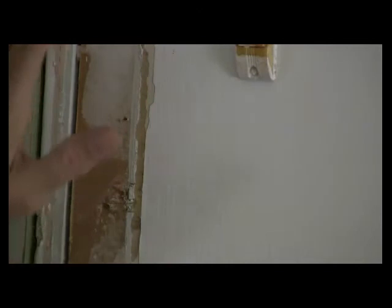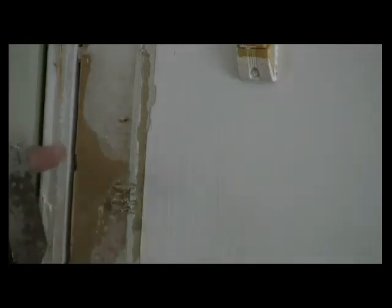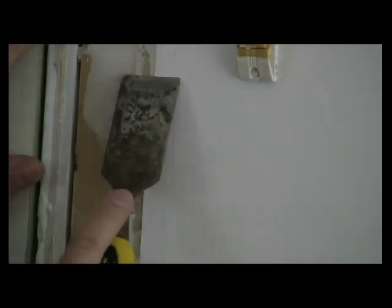Once you have pulled the trim off, take a flat edge like a wood chisel and go along the wall, straight up the side, and along the door jamb also. This helps remove some of the caulking that's still there, because you want a flat surface when you're putting on the new trim. Go with a wide chisel, and make sure it's a sharpened edge to get the most effectiveness. Do this all the way around the door.